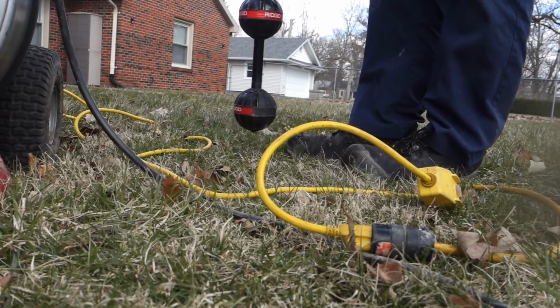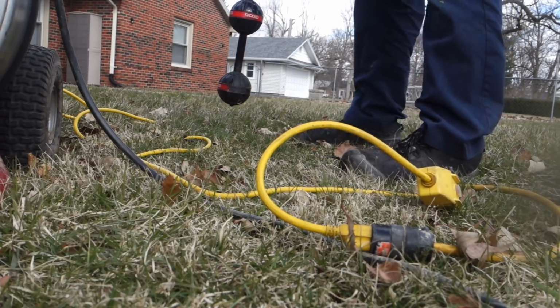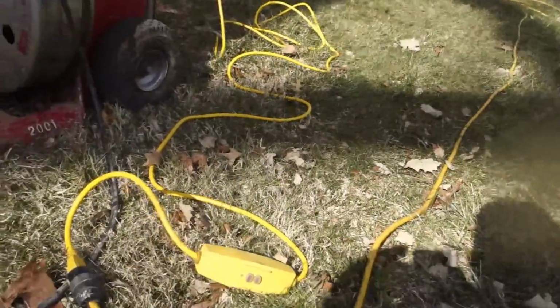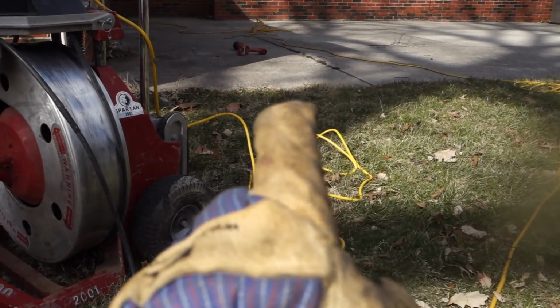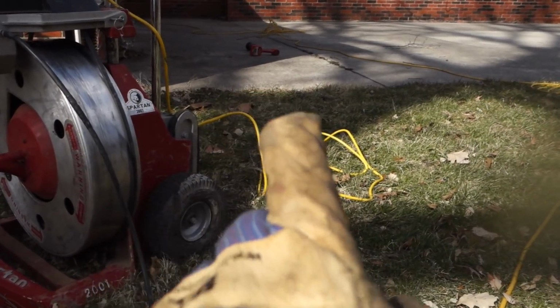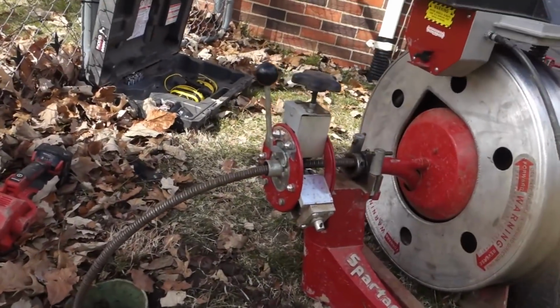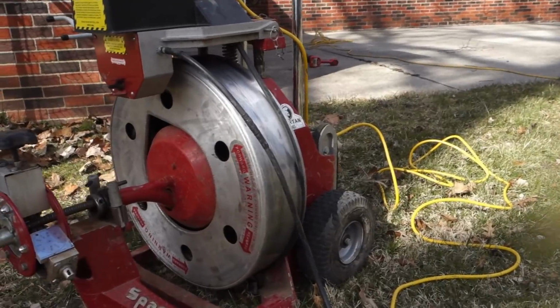Yes, thank you. 512 hertz. Perfect. Where are we at? Alright, so at this point I found out we're going that way, right where my receiver is. And we're 1.6 feet in the ground, going that way. But I still don't know if it's going back into the house, or if it's going under the house out on its way to the street.